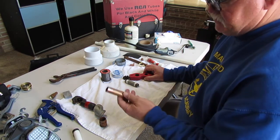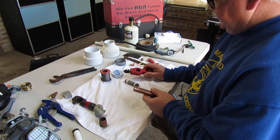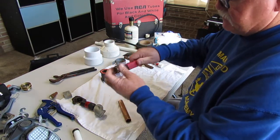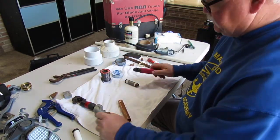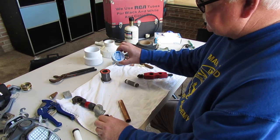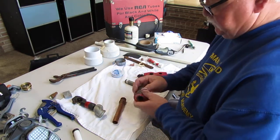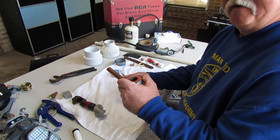Copper is also expensive. They make this cleaning tool which is designed to clean the pipe, and this one here is designed to clean the fitting itself. It's really important that this step is taken. It also requires soldering paste — you have to apply that paste onto the pipe and then slip the fitting on.